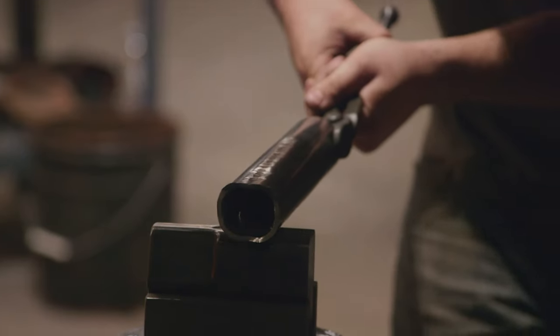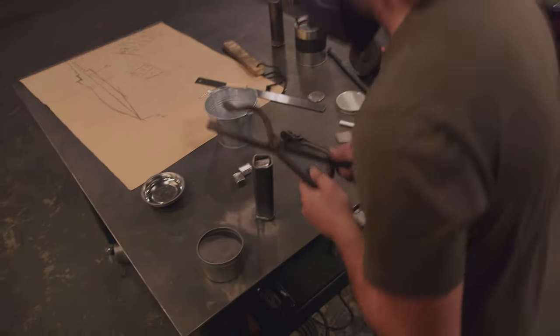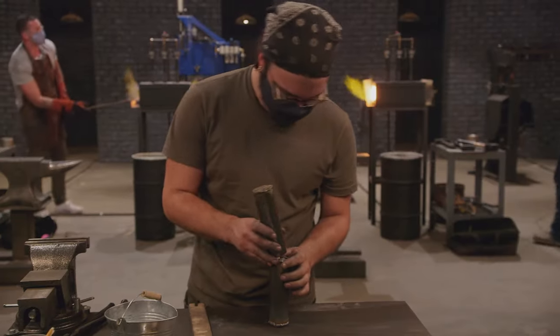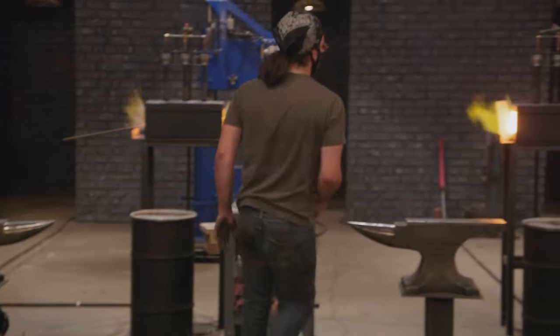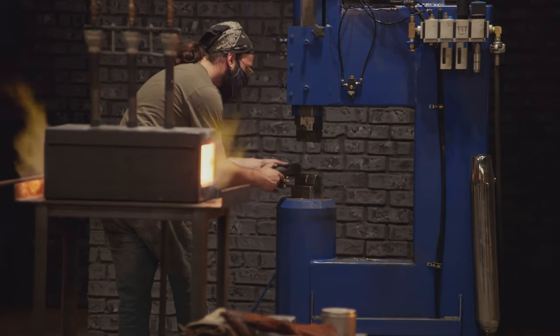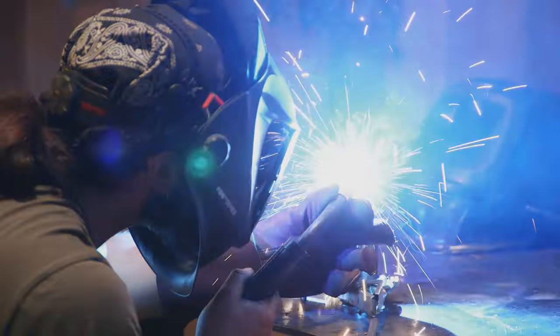Zach squared up his pipe. We always use squaring dies to apply force equally on all four faces to compress to the center, and we don't have any rounding dies. This is not all going to fit — I'm trying to fit everything in the canister and it's just not fitting. I dump everything out and try to redo it, but my canister's just too small. Then it hits me: why don't I just make the canister bigger? So I'm going to make a new piece of square tube, cut a little piece off of it, and weld everything together. This is a faster solution than starting over.